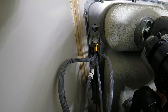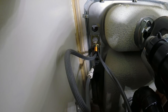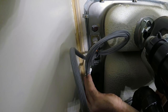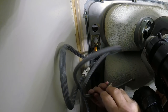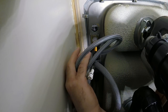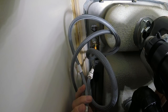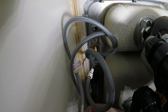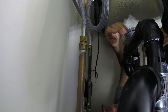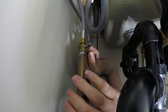What I'm gonna do is connect the hot first — the hot is marked. The only good thing about the new faucets is they come with these nice supplies. Really nice. Here's the cold — we'll do two at once. Can I see the 5/8 wrench, Chuck? Because all you gotta do is snug these up — they've got a nice O-ring. Snug. Snug.